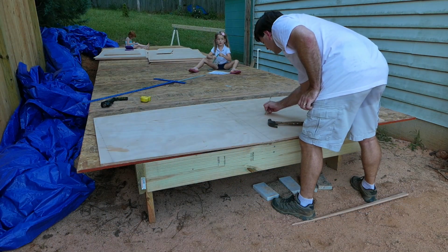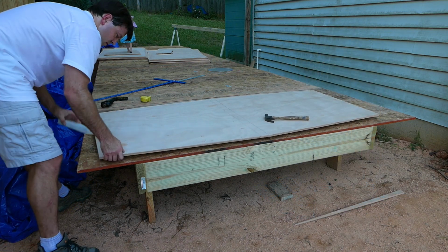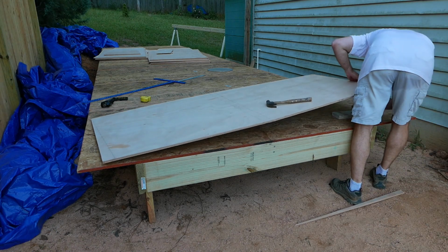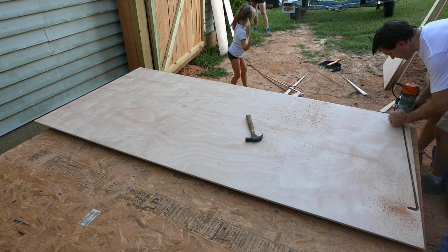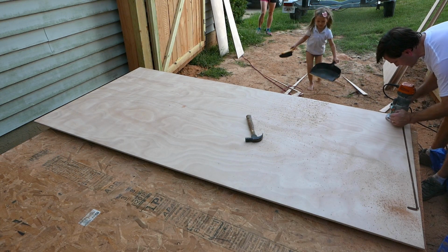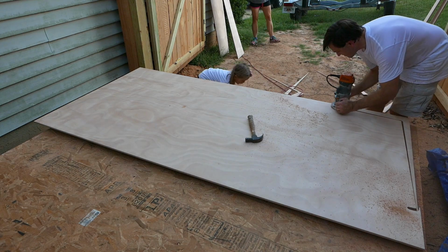To get the desired thickness for the bow and stern transoms, multiple half-inch thick panels must be glued together. The bow transom is laminated from 2 panels, and the stern transom is laminated from 4. In each case, I measured and cut out the first panel to determine the shape. Then I propped it up on blocks so I could trace around it using a flush cut bit on my router to cut the remaining panels. This is much faster and results in an exact copy.